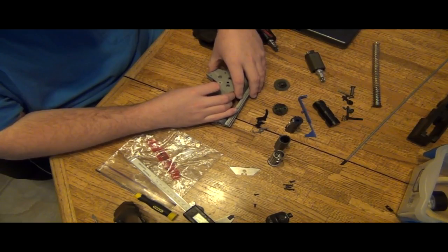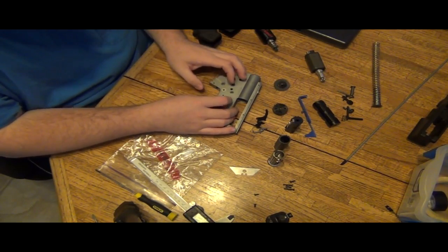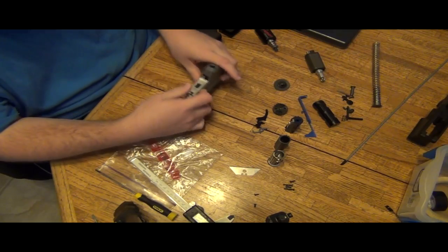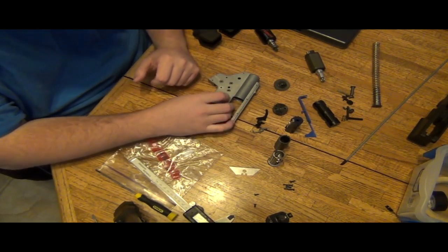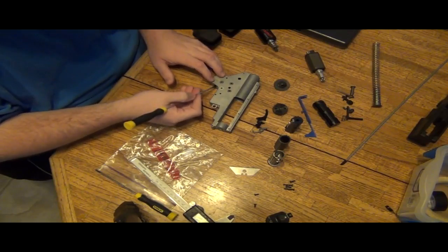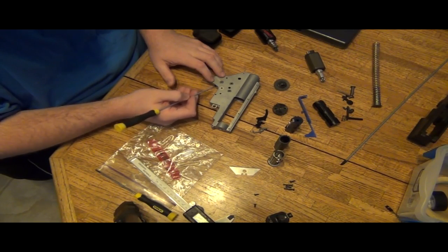So this is kind of the process of shimming the gears. You'll close this up, and you'll screw it down on the screws near this area, as tight as you can, not over-tightening, just tight to where it's supposed to go. And then you'll check your bevel gear. Now I use this, and I pull it up. You can see there's a lock there, and I'll rotate it.